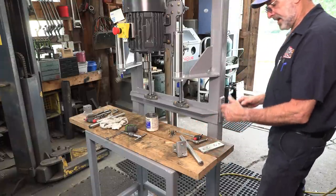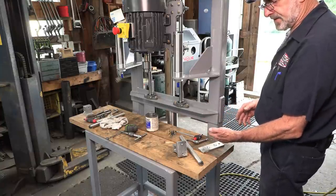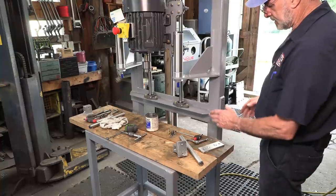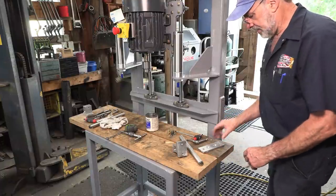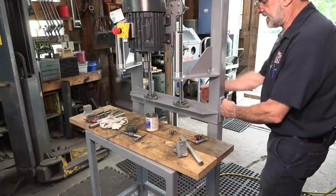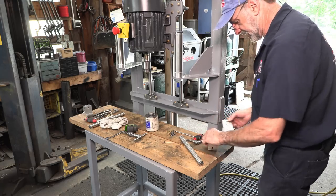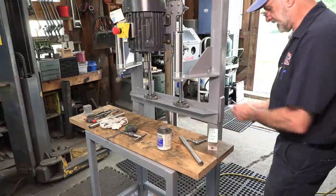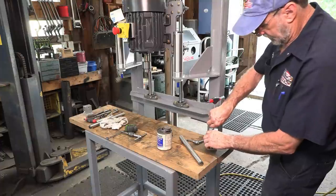The change from my original design was because when I first built them for Cape Cod Fence over there, they didn't tell me they wanted a backstop, so I made a clamp-on unit, and it clamped on just about in this area right here. So I make a welded plate and drill and tap it, so now we don't have a whole bunch of clamping hardware we don't need. All right, so basically this mounts onto the back of that plate, and then that plate assembly mounts right to the frame itself.